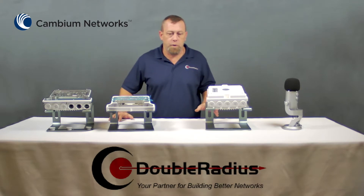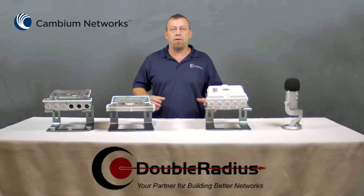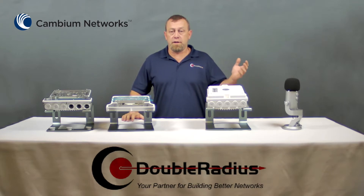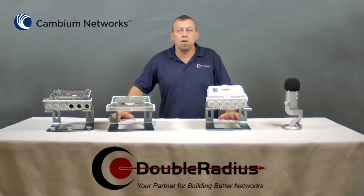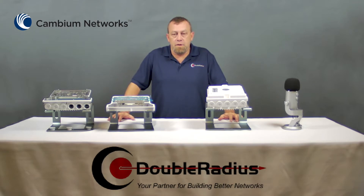Why is all this important? The main reason is that if you think about the capacity of wireless today and the channel sizes granted by the FCC, the speeds can and will exceed 1 gigabit. So if the radios can go faster, shouldn't the ports be able to support this? The 850 does. Changing these ports alone allows us to do full-speed MCABC — Multi-Carrier Adaptive Bandwidth Control — which enables separate radio carriers or cores to be shared on a single port and cable.